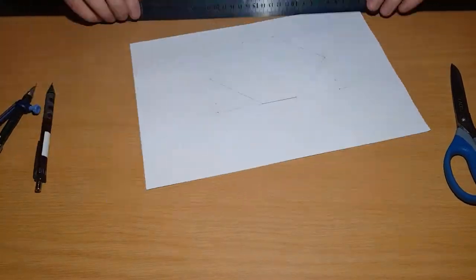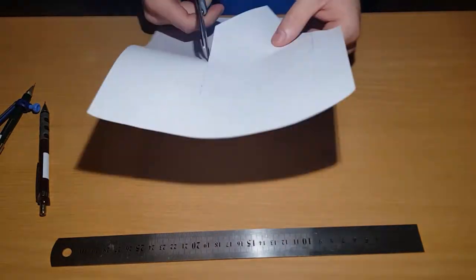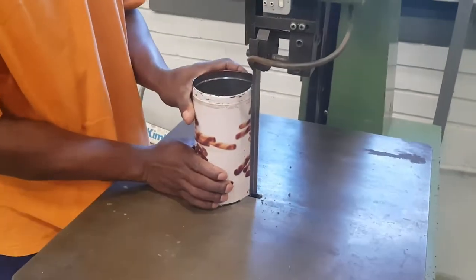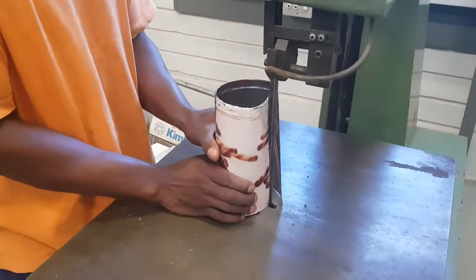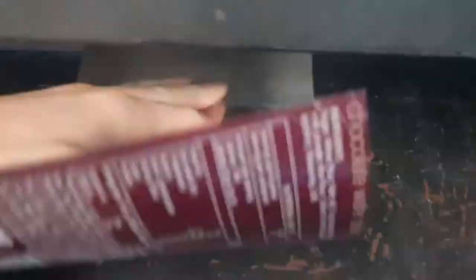Note the tip-to-tip dimension is 140mm and the width is 100mm. The next step is to cut the dry produce tin. The bottom of the tin is cut out using a can opener. The resulting cylinder is cut at the seam using a bandsaw. The tin is then flattened as far as possible. A guillotine is then used to cut the antenna from the tin once the dimensions have been transferred from the template.